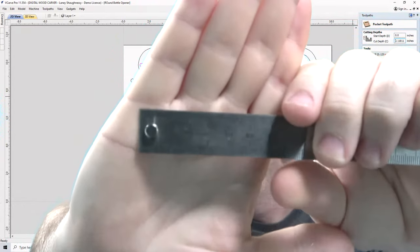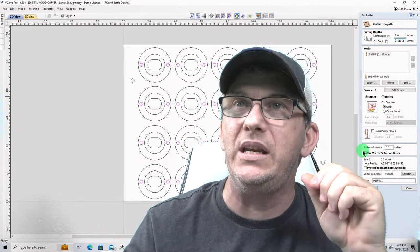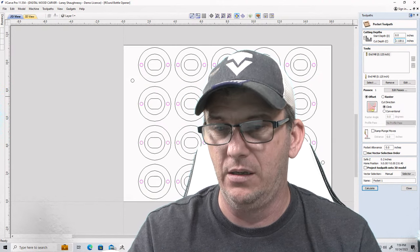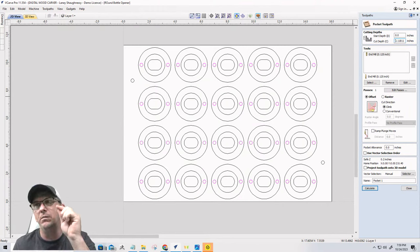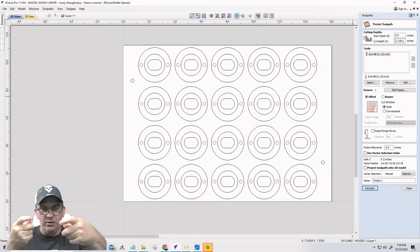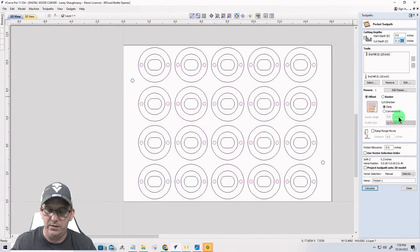They're very, very thin. So 3 millimeters is 0.11. We want to make sure that if we cut our pockets, we give ourselves a little bit of shallowness, because we've got to think about epoxy. We're going to be epoxying these in with a little two-part epoxy. You can get little squeeze tubes or whatever the case may be, but epoxying is the best way for them. So for me, 10 thousandths is a little bit much, so I'll add another two. I'm just going to go 0.125.